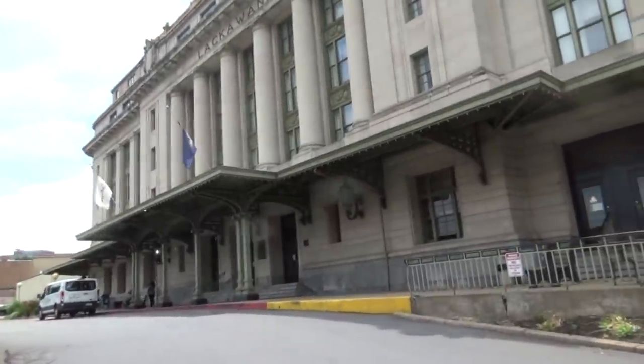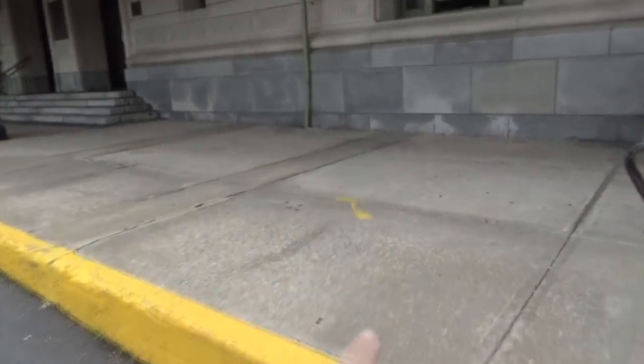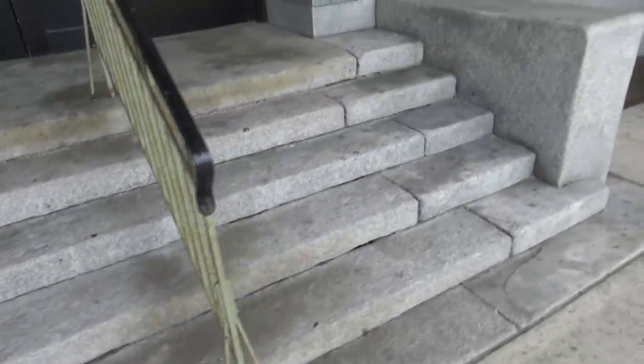This is the old Lackawanna train station in Scranton, Pennsylvania. All these old limestone buildings — a lot of this was paneled and made — but look down at the bottom: this is granite. In most cases they call this a water table in our area, because water doesn't go through the granite, and when rain splashes down against it, it won't do the damage it would to the limestone. In England they call it the damp course. Over here we have granite steps. Everything wears away sooner or later, but they've been here 130 years or so.